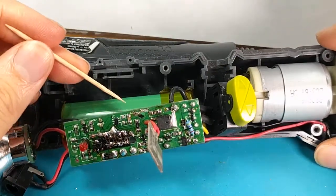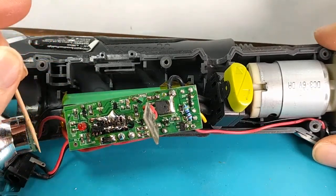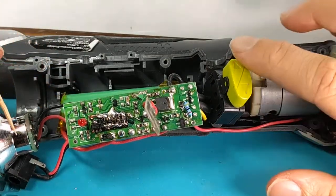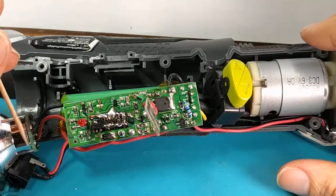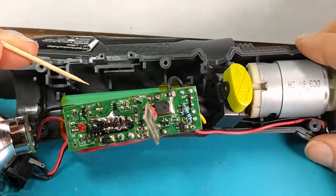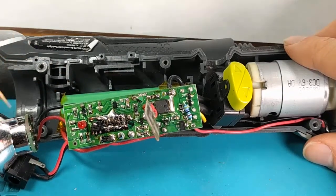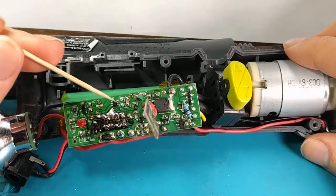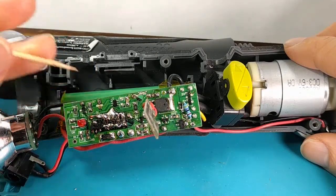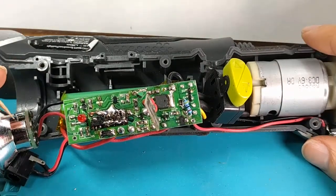One last note — I replaced the fuse for the power input, because that had blown. I think it was only one amp, so I probably drove it while it was plugged in. When you turn on the motor while it's charging, it will actually draw some of that charge from the charger and blow the fuse. Also, this component right here is actually a reverse-polarity protection diode — so if you plug it in reverse, it should blow the fuse rather than damage the circuit. Then I kind of reflowed things a bit, and I'm going to clean it up with a little bit of alcohol and call it a day.